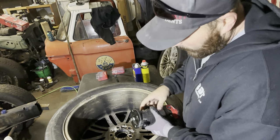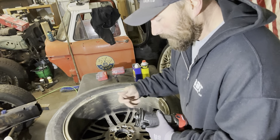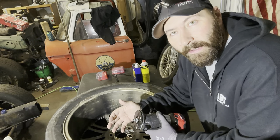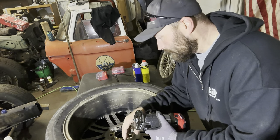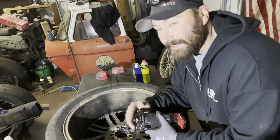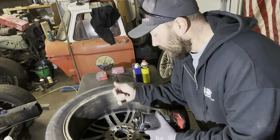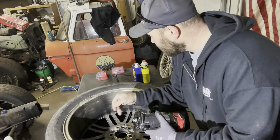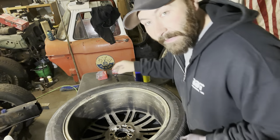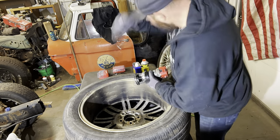We're good to go now. I put the bit in for an eighth inch, so it's gonna be an eighth inch with a rounded edge. I'm going to hit it first and see what it does — I don't want to take it all out at one time because you could break your bit. We're gonna take the eighth inch out and check; if we need to take a little more out we can bump up to the next size and go with a quarter. Cover your ears — it's gonna get loud. Put your safety glasses on, can't forget that stuff.